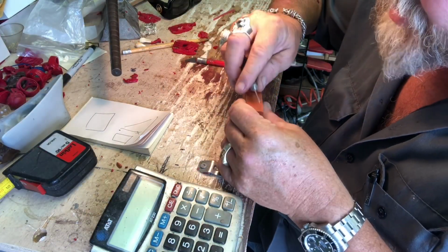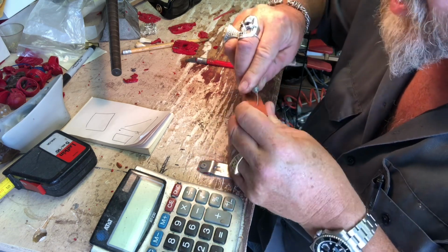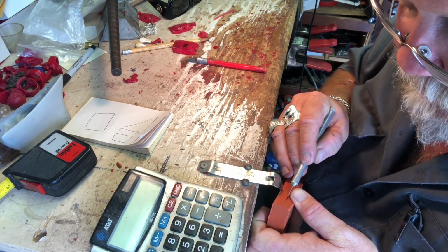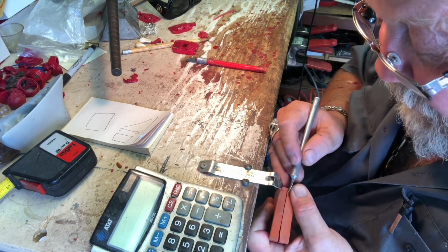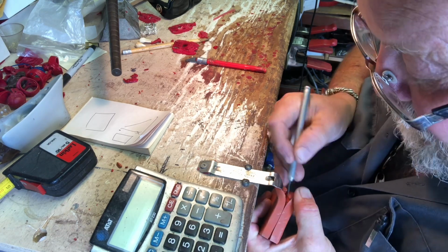Not your standard shape of mold. For the professionalism, we want to cut it about a millimeter and a half deep. You get a nice little cut there. There's the X. So let's cut along here a little bit. Then we're going to cut a lock in the corner, or a tab, depends on where you're from and how you want to call it. They don't need to be huge. And here we cut another one. Notice I cut my tabs in the same direction. Look at that, and that's nice.